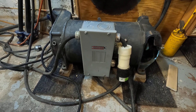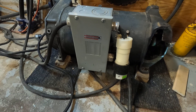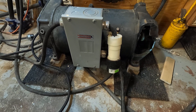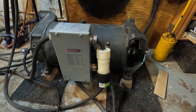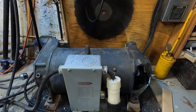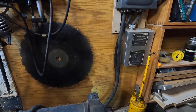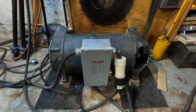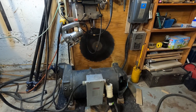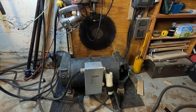So in reality, if you found a $400 milling machine at the junkyard, you could buy a three-phase motor at the local motor shop — it's about five bucks per horsepower — and instantly be able to power your machine. Adding the static phase converter makes starting it easy. They've got that on eBay for something like $209 for a 10 horsepower. You can build your own setup for just a couple hundred bucks, under $250 — one quarter of the price of a commercial rotary phase converter.